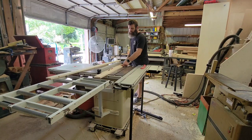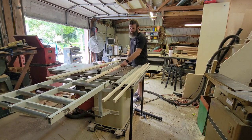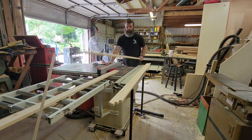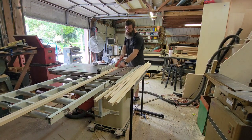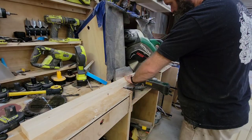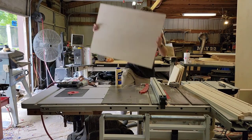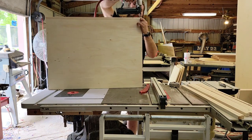Now I'm making the edge banding for those panels. I went with a thicker edge banding instead of the normal thin piece, because some of them we're going to have to cut into, and it just looks better. These are about the same thickness as my plywood but maybe an inch wide. I got it all stacked up and I'm cutting it to rough length — not exact, because I'll trim it later when it's glued on the panel. The process is basically: put some glue on the front, stick an edge banding piece on, and nail it in.